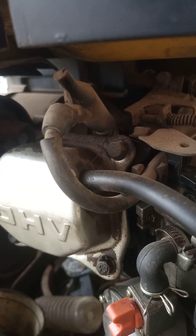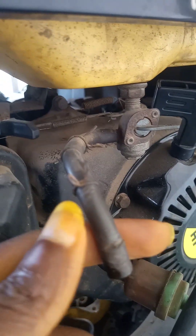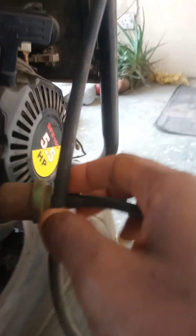Right now I have tested this generator with this improvised one-liter tank which was used to run this generator. As you can see, I did not try to use petrol from the tank — I actually took it off and closed the gates, so you can see it's not connected to the generator. What I did was look for this one-liter plastic container, then brought the hose all the way down to this improvised filter, which goes straight into the generator carburetor chamber.